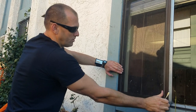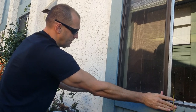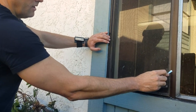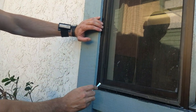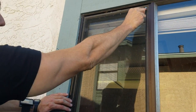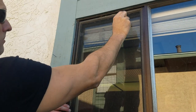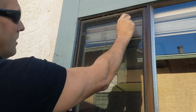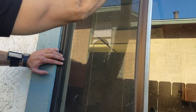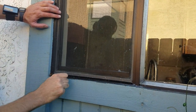I'm going to push where the springs are, and that's going to give me a little room to get my tool in the opposite area, but there might be a lip down here. So you want to find the spring, find the opposite side of the spring — opposite lower side. Then go directly across the window to the opposite upper side and push up with your screen extractor. Not a screwdriver, not any other tool. Push up, push in, loosen the screen up — push up and in — and that should lift the screen a couple millimeters off the ground.